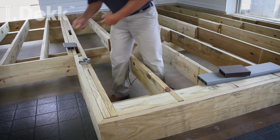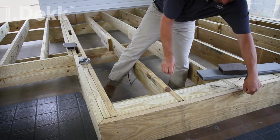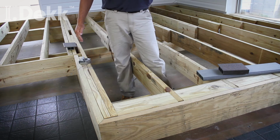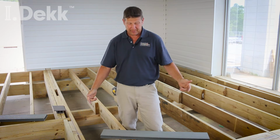box cutter. So I'm going to bring the string into that notch, across to that mark, snap a line. We've now got a starting point at a true 45. Okay, we've established our 45-degree angle. It's a true 45, 36 back from each side.